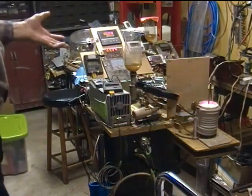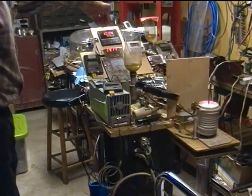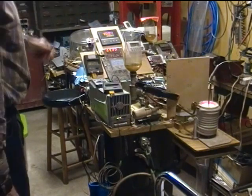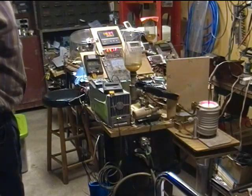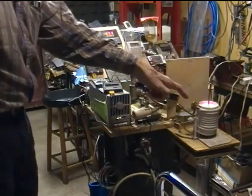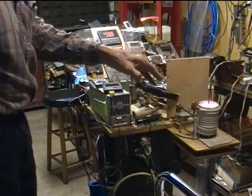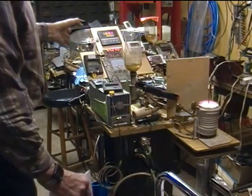What we're doing here is checking out the solid state relay being controlled automatically by this $24 PID controller, which is, I'm sure, a Chinese knockoff. I chose 1000 degrees Celsius for heating up this copper because I wanted to just get this cycling going. If there was a heavier load in there, we'd have a higher percentage on-time. We can see that the SCR is doing its job.